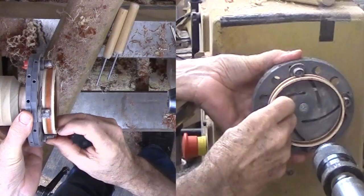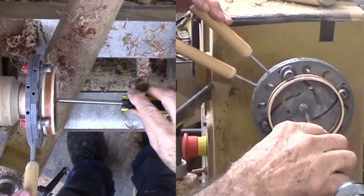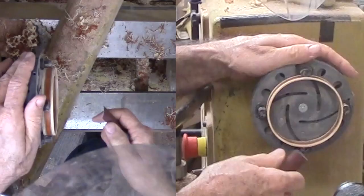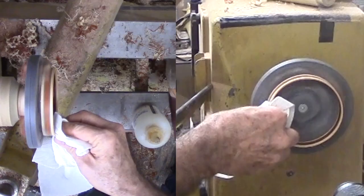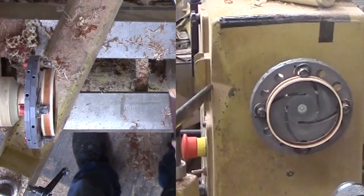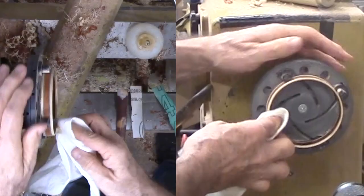Back at the wood lathe and my new mini Longworth chuck. I found it as difficult to tighten as its large relatives, so I added finger grab holes and tommy bar holes - tommy bar holes were the best addition. I found it best to loosely attach the chuck to the faceplate first, then loosely position the ring to the chuck, tighten the chuck with tommy bars, tighten the knobs, and finally tighten the central screw between the chuck and the faceplate. With this size chuck, I could hold the tommy bars with one hand. Then it is a matter of sanding up through the grits and applying shellac. With the first mount, the pins are on the outside and I can sand the inside away from the chuck. Second mount, pins are on the outside and sand the opposite inner surface. Third mount, pins on the inside to sand and finish the outer surface. Fourth and last mount, pins on the inside to sand and finish the remaining part. I like oval pins with a ledge - the oval shape keeps the pin from spinning while tightening the nuts on the opposite side.